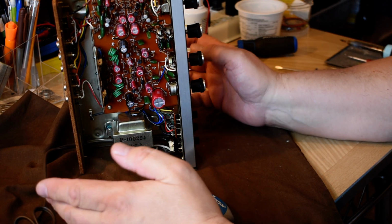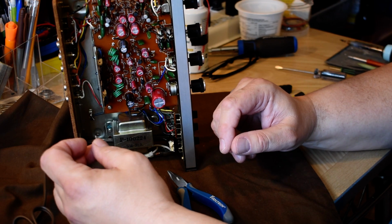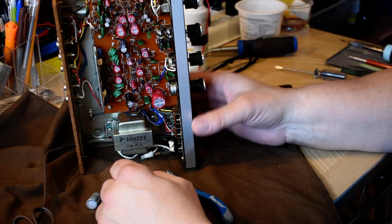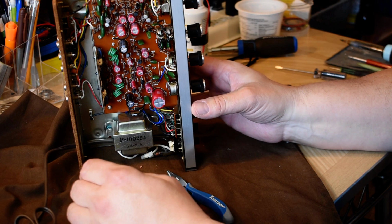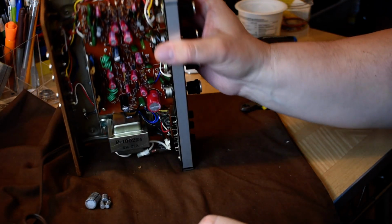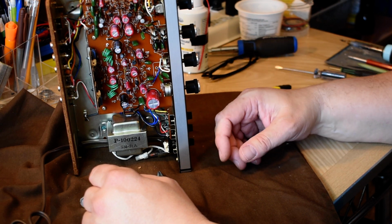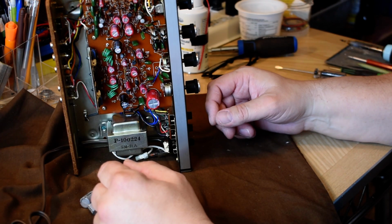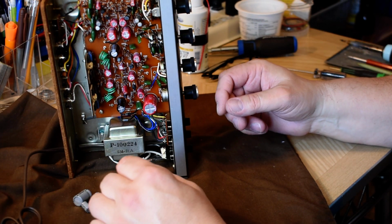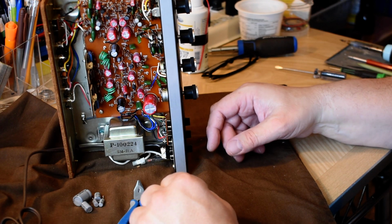That came from some work that somebody did at some point. And I can tell you it's happened to me. I thought I counted for every little piece I snipped out and tossed in the garbage, cleared things off, and used compressed air to blow it out. I had a Yamaha CA-510. I changed a few parts around the output stage and a new relay. I looked at it very carefully, turned it upside down, shook it out, blew some compressed air in it, because I thought there was one I couldn't account for. Plug it in, turn it on, I'm listening with headphones, something coming off my computer, and I just moved it like this to put it down, and there was a flash under one of the output transistors. Very similar thing to this, soldered to the board and heatsink. And then it went into protection mode.